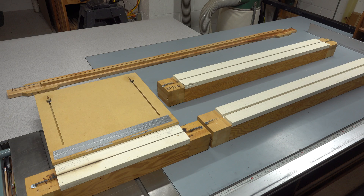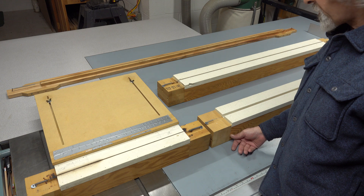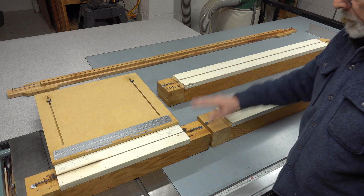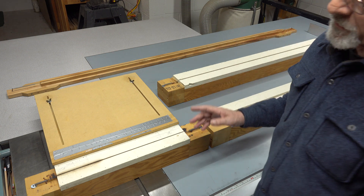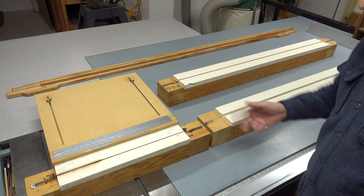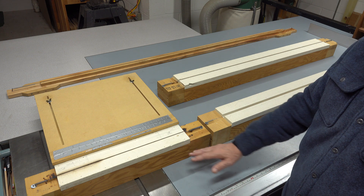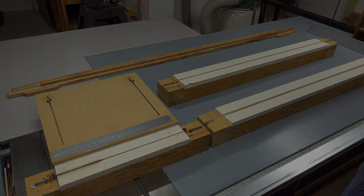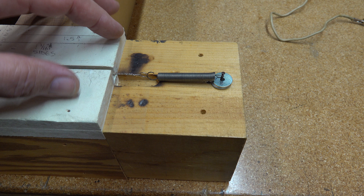Today let's have a look at bending plastic — DIY homemade strip heaters: four-footer, two-footer, six-footer, all with 20-thousandths nichrome wire. You're going to need a rheostat and just a couple of little accoutrements — small wooden fixtures that'll make your life easier. Let's have a closer look and talk about how to string your nichrome wire.